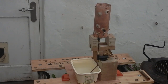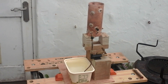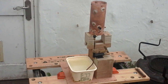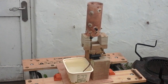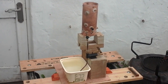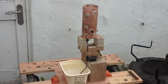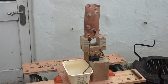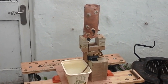Hi folks, here's the second video in the small series about this little steam boiler that I'm making. I'm just about to give it its hydraulic test, which is a water pressure test. This isn't the first time I've done this unfortunately — the boiler had a small leak which the previous air test, which you saw in the first video, did not reveal. So I had to take it back to the bench and re-silver solder one of the joins — where the fire tube joins the end plate.